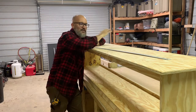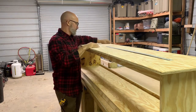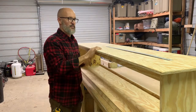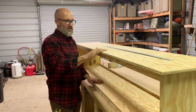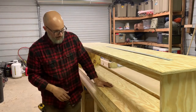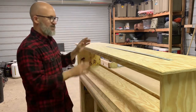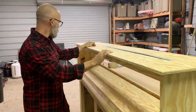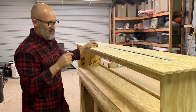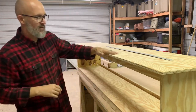Got it this far. This was a terrible piece of plywood — an extra piece I had sitting back there from another project. I shouldn't have used it; I should have gotten a better quality one. That being said, it's already put together and it didn't turn out terrible, but I am going to have to put in a divider or support because this plywood was so bowed that it may go down under weight. It's a little bit longer than the other one because I had more space between the window and the wall. I'll put in the support, add a plug in the top, hang the French cleat on the wall, set it in place, and screw it into the nailer strip. Hit it with a sander a little bit, but it's looking okay.